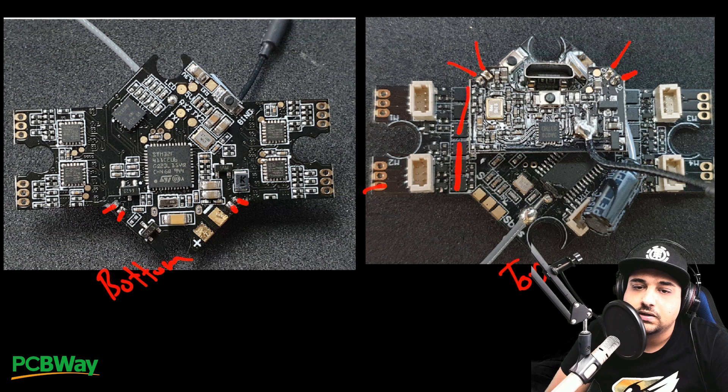The repairability is pretty simple if you're able to find these correct FETs — maybe if you talk to Emax they'll let you know. That's relevant when you have a motor stuttering. The most likely thing to be damaged would be one of the FETs here, unlikely to be one of the resistors connected with the gates. So you'd be able to just quickly pop one off and put it in, but you'd have to replace all three since you wouldn't know exactly which one is bad.